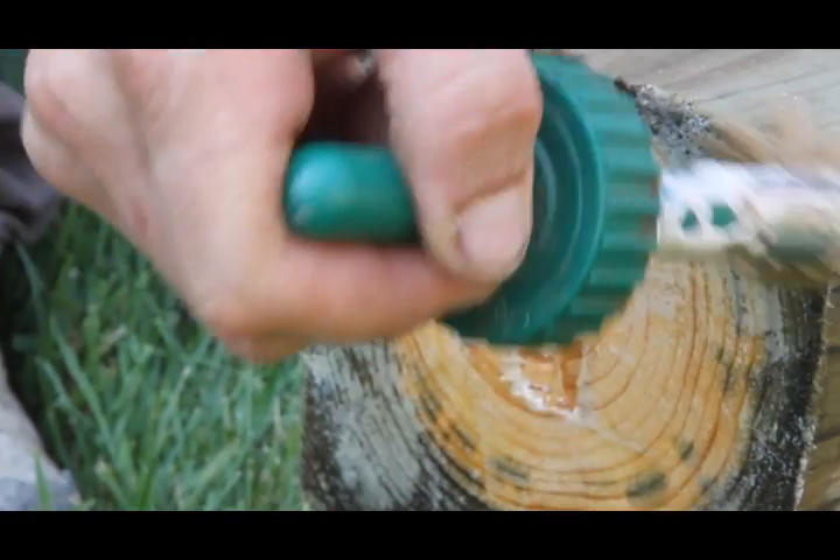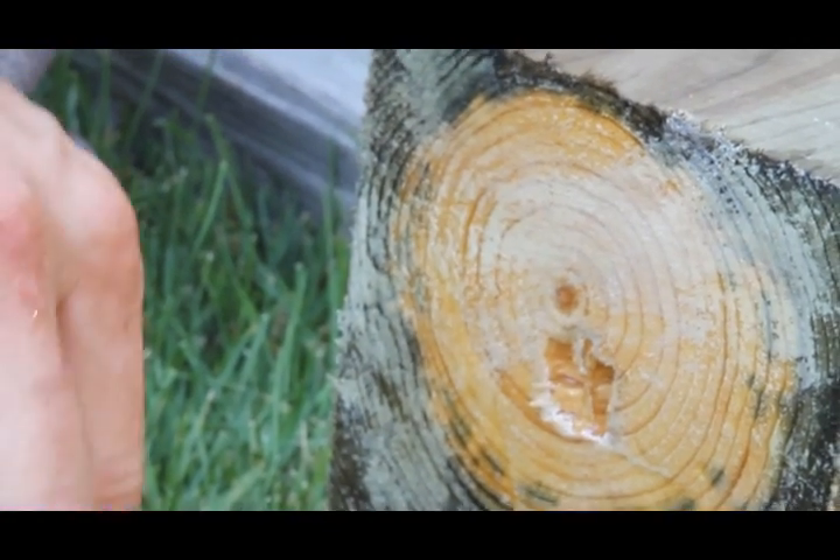If you've got a little bit of an idea of how that deck is built, you're going to end up with a much better product and the right person. Another thing to look for is that your contractor, when cutting the pressure treated lumber, applies an end cut treatment. This is a chemical that seals the end of the spongy joist to make sure no insects or rot can penetrate through the vulnerable end cut of a piece of wood.